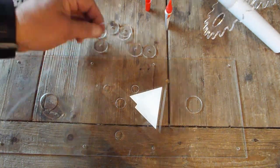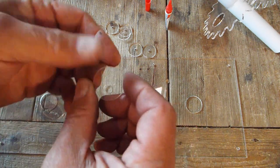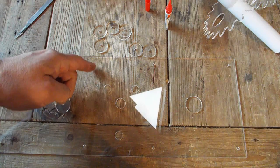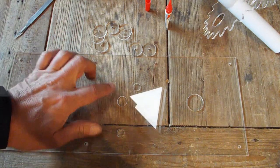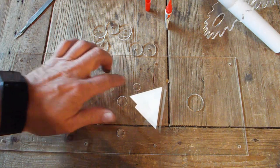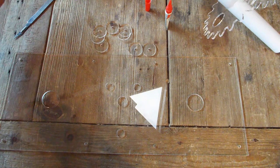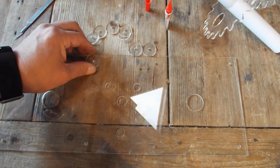Alright, so I finished peeling the paper or plastic, depending on what your kit has, off of these little spacers. And what we're going to do is take the four that go around the rotisserie mount point. So you know this is the back plate because it has the rotisserie screw holes for the screws for the rotisserie mount plate to recess into.